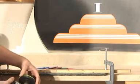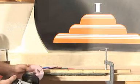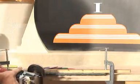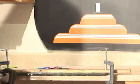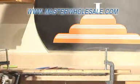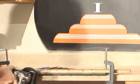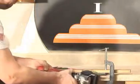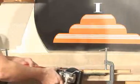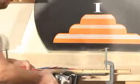Remove the 50 grit and move on to the 100 grit. It is important with the 100 grit to make sure to remove all saw marks and imperfections prior to moving on. Work the stone from left to right. When you are sure all saw marks and imperfections are removed, you will be ready to move on.